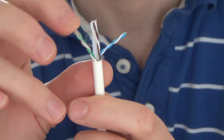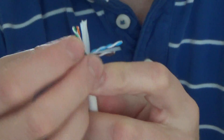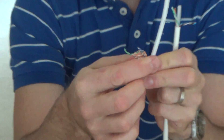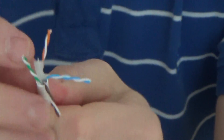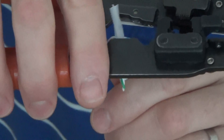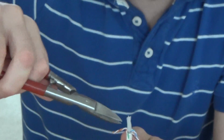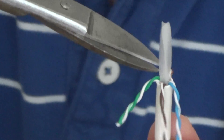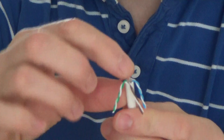Now at the moment this still looks just like CAT5e cable, but when you strip it back you can see it's got this plastic cross member going right the way through it. This actually separates each of the pairs of wire in the CAT6. On CAT5e all the wires are bunched together - twisted in their pairs but bunched together. But on the CAT6 you've got a plastic cross member that separates them all, making the cable slightly thicker and a little bit harder to terminate. So what I do is fold all the wires out of the way and I like to get right in at an angle - making sure you don't snip the wires - and cut each part of the cross. The cuts go deeper down, so it won't get in your way.